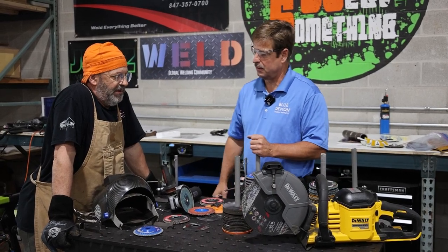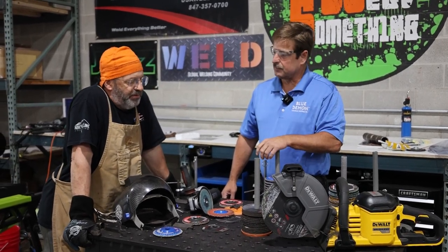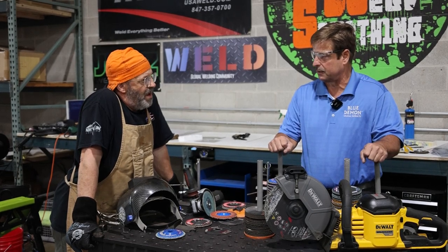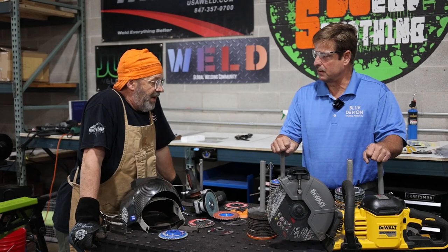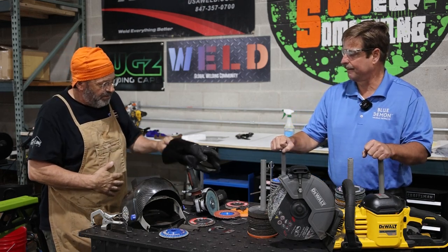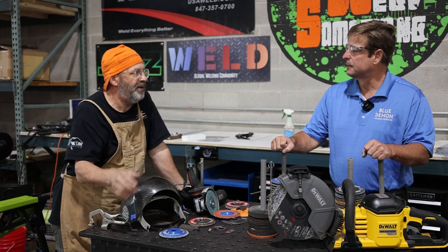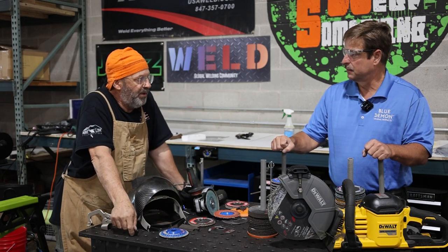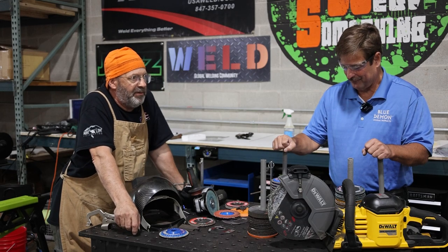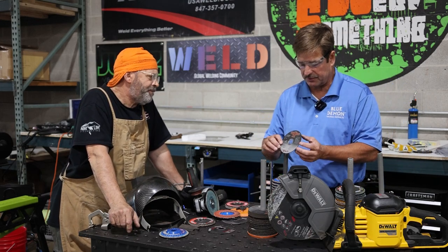Abrasives are inherently dangerous because of the RPM and centrifugal force — that's what gets to the bond and the grit. When abrasives come apart, it's about as fast as a speeding bullet. I can remember getting hit — I had a pipeline wheel explode in a controlled R&D area at Conoco. Lightning fast. I had a welt underneath my eye with my face shield and safety glasses on. Had a welt right here that looked like somebody hit me with a bullwhip. My eye is still intact, but it was a microsecond in time — you can't get it back. Always be careful.